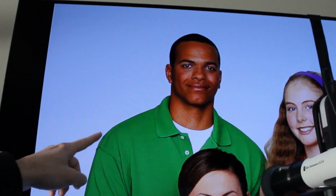Also, I can tell the sharpness is too high. The reason I can tell is because there's a very hard line between his shoulder and the background, and he almost looks like a cardboard cutout. I'm not sure if it's going to show up on camera well or not at all, but he also has a lot of noise in his shirt, and just overall the picture is very noisy. So these are just some of the things that we're going to be able to fix during the calibration.